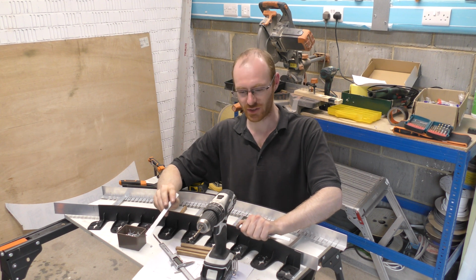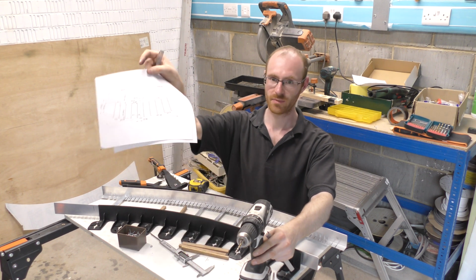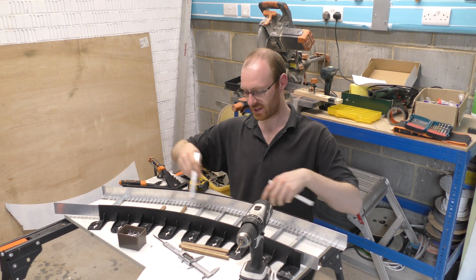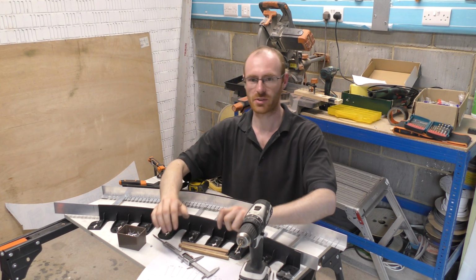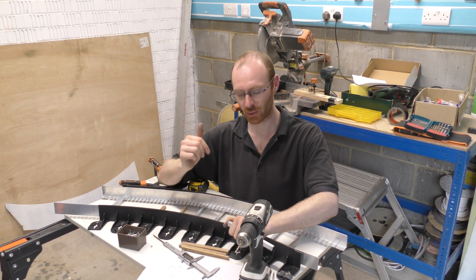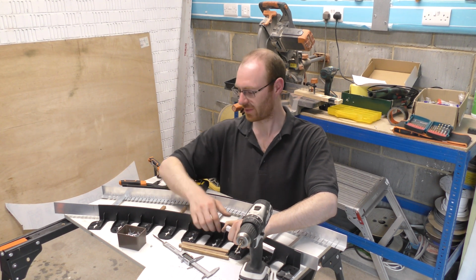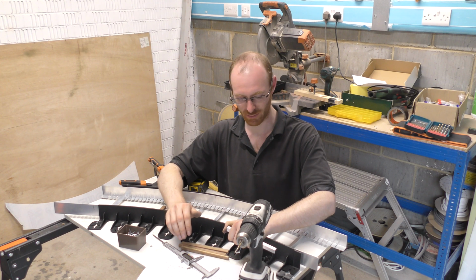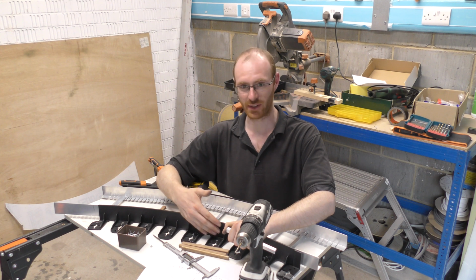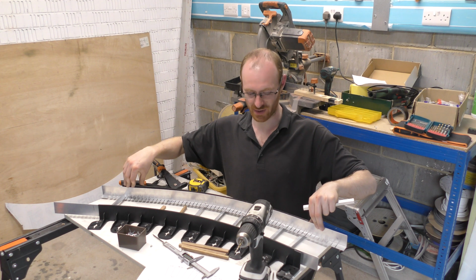So what I've actually then done is do another drawing. I'm swimming in the things now, which has got me distances between on a radius, and then I also put it in this jig. And I've made this, if you've been watching our main build log, out of flexible edging strip for lawn. We're using it a bit differently but with a similar idea, but as I've had some, and as it's flexible and can take screws, I've actually used it as a jig to form my two sides on the right radius.